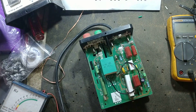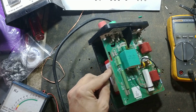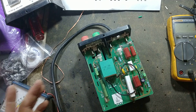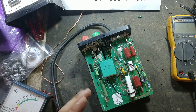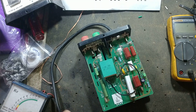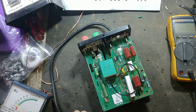Hopefully you liked that video — I thought I'd try it out and take you along for the ride. You've got to be careful doing this kind of stuff because these transformers can only handle so many joules of energy dumping into them from the capacitor. Gallagher's old-school transformers are really well built and hardly ever go bad, but you wouldn't want this thing putting out like five, six, or eight joules because the transformer would get hot over time and burn up. That's why they make different transformers for different size units rather than a universal part. Anyway, like the video, hit the thumbs up, share it with your friends, and until next time — bye!